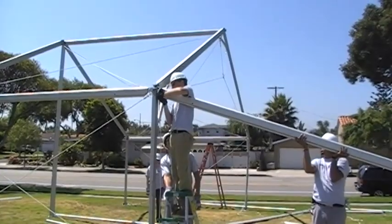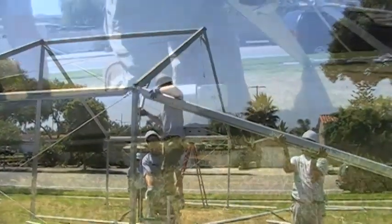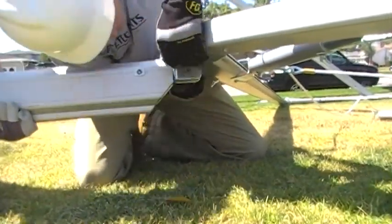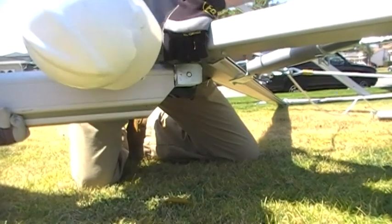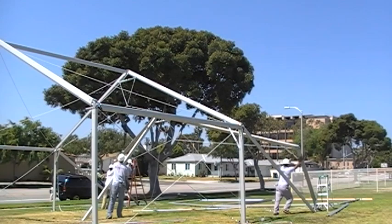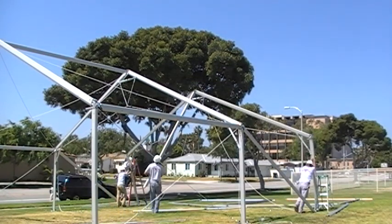You can now install the roof cables and wall cables into this end bay. Connect the eave purlins to the next bay and pin into location. The ridge purlin is pinned on the ground and is used to help push up the beam. Continue tilting up the balance of your beam arches and connect purlins as you go.